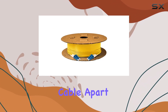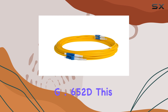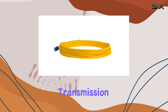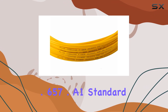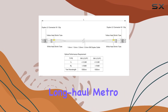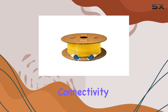What sets this fiber cable apart is the use of Corning SMF 28 Ultra Optical Fiber, which adheres to ITU-T recommendation G.652D. This ensures not only low-loss transmission, but also exceptional bend performance, surpassing even the ITU-T G.657.A1 standard. Whether you're looking at regional, long-haul, metro, or FTTH applications, this cable promises seamless integration and superior connectivity.